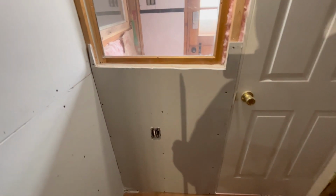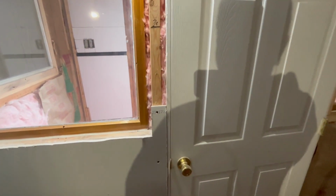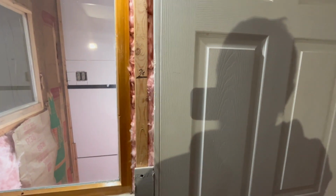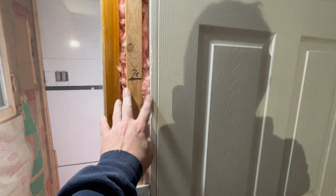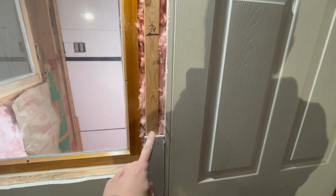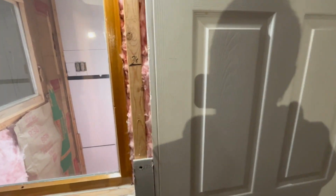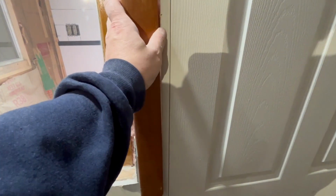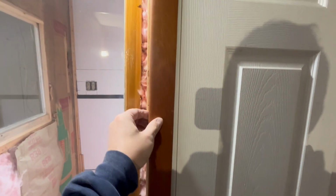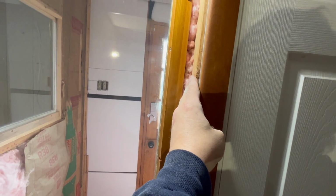As you can see, I got more drywall work done. Just wanted to stop and mention something here, because it might seem like these are kind of close together, but keep in mind where your seams lie, because here's something that will actually work out just about perfect for me. Instead of having to redo all those, I can just do it kind of, and then when I put my trim on here, you can see that's going to be here, and there's going to be another facing board flat here.